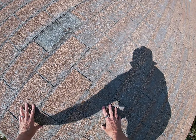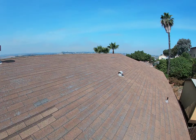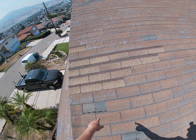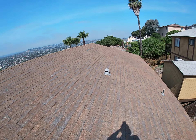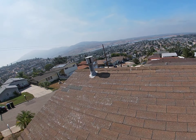The first thing we notice up here is a really weird hump right there. You've got missing shingles with exposed nails, and there's at least one spot with a missing shingle and no nail at all. There's quite a bit of granule loss all the way around, and you can see missing shingles over here as well.